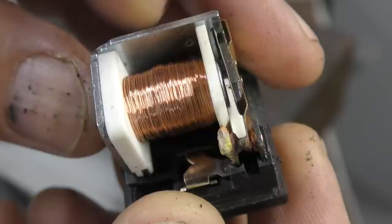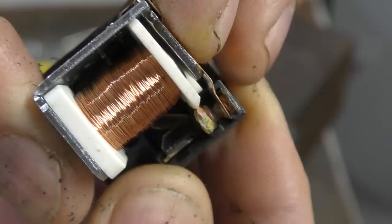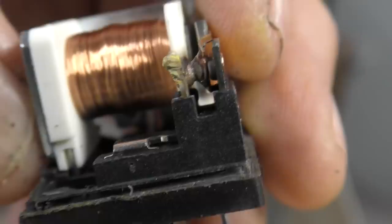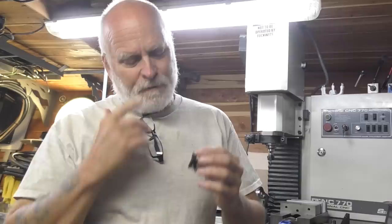What's supposed to happen here is this coil energizes, creates a magnet, and pulls this piece of metal down. That copper should move when the metal comes down, open up that contact and close the other one. But you can see that they're both closed - they're just welded together. That's what 24 volts and a lot of back-feed current did to it.